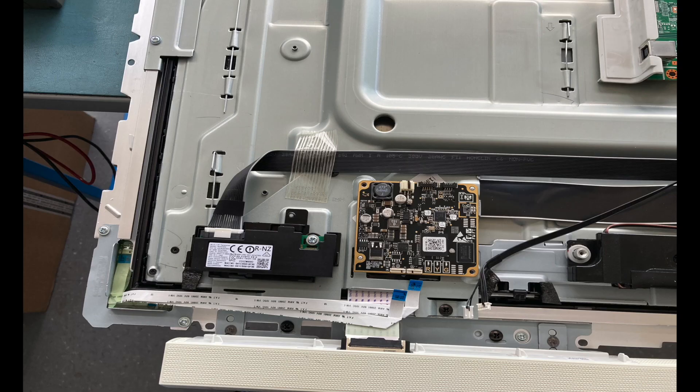So the primary suspect was of course the touch interface or touch controller, which is in the lower left corner, seen from behind, of the touch monitor. This little board here with the golden edges. And I noticed that none of the three LEDs, which are marked red, yellow and green, lit up.